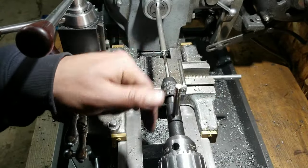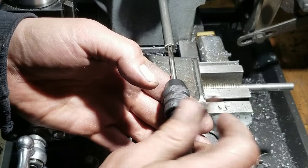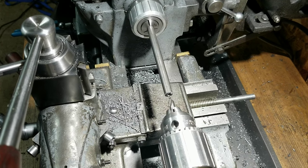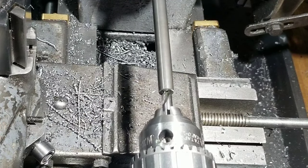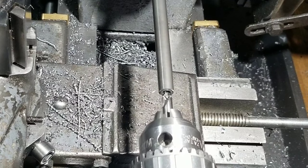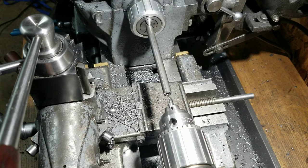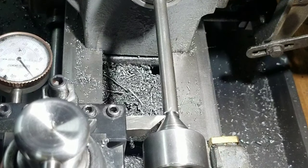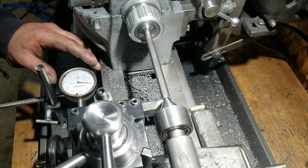We're gonna go in there with a bottoming tap too, since we have one. Alright, I'll put a little bit bigger center drill in there. I checked so the tip doesn't actually damage the threads. Just so we can get a good register, plus it chamfers it too. Alright, so now I guess we're going to need an indicator. I ground this tool for making my pulley, and it's got a really fine point on it, so I'm going to kind of roll with that. So we have clearance for the thing there.